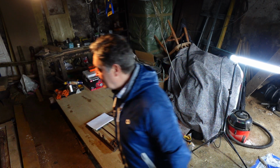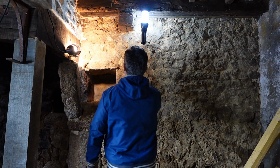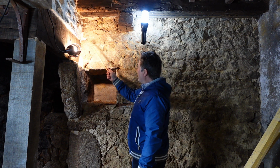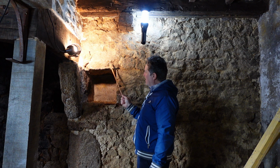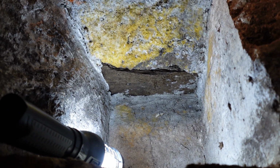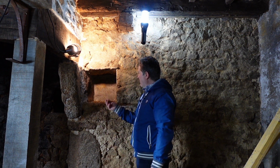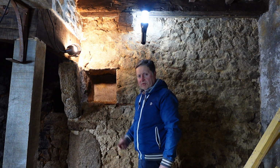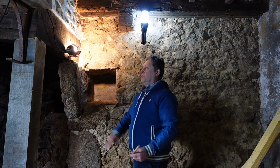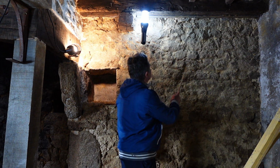Follow me. Don't think there's been any major leaks up above on this side. This is absolutely solid, which is a bonus. There's no damage here. We've got a stone lintel here. There is a wooden one behind it. It feels pretty solid. This whole area is much drier than the other side, so yeah, touch wood. I think we're okay this side. Wall looks pretty sound.